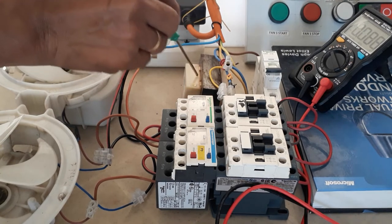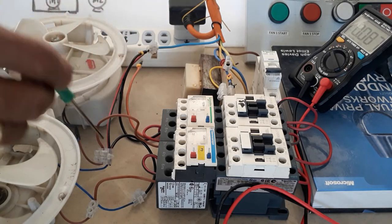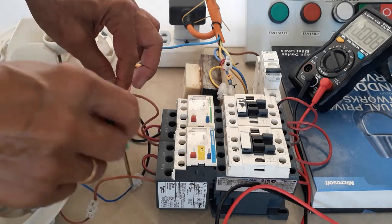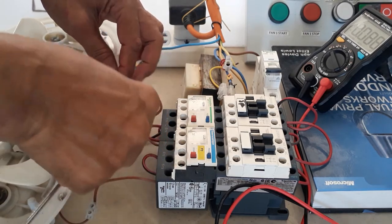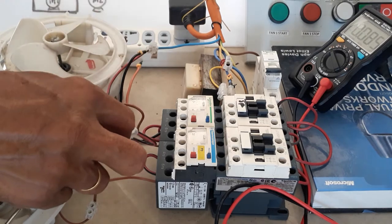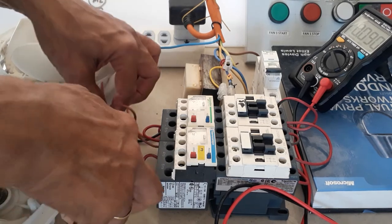My neutral is connected to my step-down transformer, 220V to 24 volts. I also connected the neutral to my fan neutral leads. Don't worry, the circuit is not yet energized. As you can see, my circuit breaker is still off. The neutral is provided here — blue is the neutral.